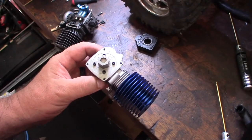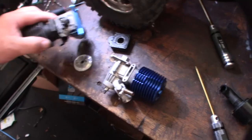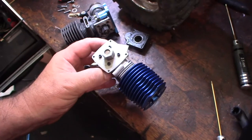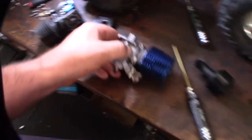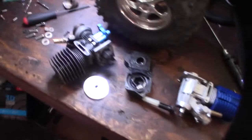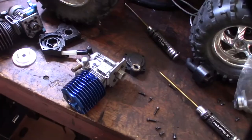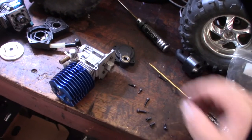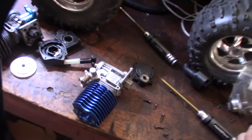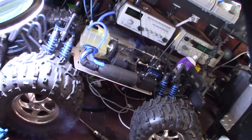The rear plates are different — the size here and here. This is actually a larger diameter one. The pull start hole spacing is bigger. I do have extra parts; I have to try to find one, and if not I'll buy one. This hole pattern is actually like a big block — I actually had some extra ones for my big blocks. I don't typically like rotostarts or any sort of pull start. I prefer a bump box, but on this truck you can't get a bump box to it.